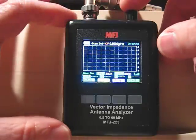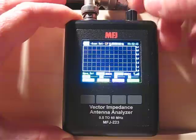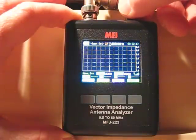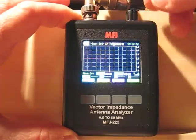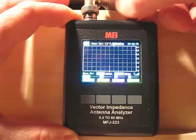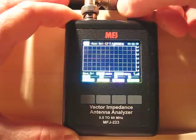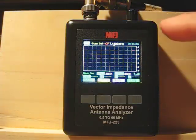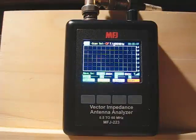Right now the span shows 650 kilohertz. I'll push the button a couple of times to move the cursor to the left, then dial up to 7 megahertz. We want to set it to 7140 — so we move the cursor under the appropriate digit and dial it down to 7140. Now we push scan and let it go.